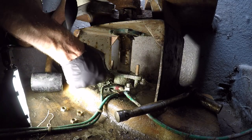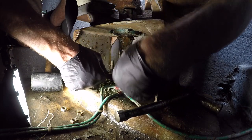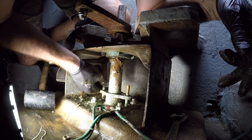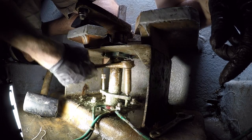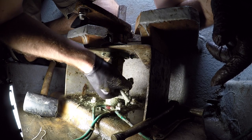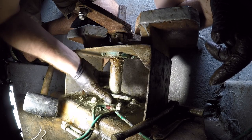I couldn't work it loose. I later figured out it was from the corrosion on the shaft above that part. So in the end I reinstalled the nuts to back the studs out. And once I got the studs removed, I was able to lift the clamping piece up.